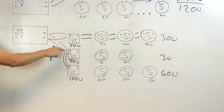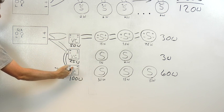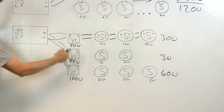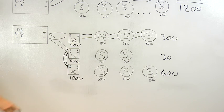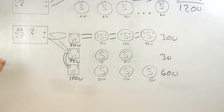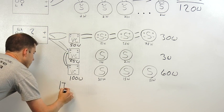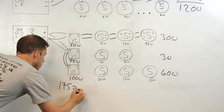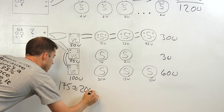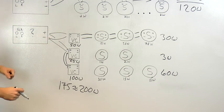Now it's important to note you want to definitely connect to the input side, because if you go to the output side, you're going to attenuate the volume control in zone 3 from the volume control in zone 2. With all of our zones running back to our amplifier, how big of an amp do we need? You can calculate it one of two ways: you can either add up all the wattage of all your volume controls — in this case, 175 — so you'll approximately need a 200-watt amplifier or greater.